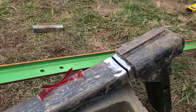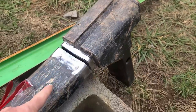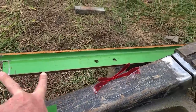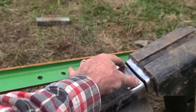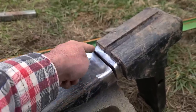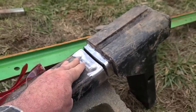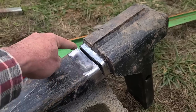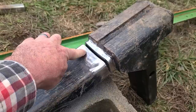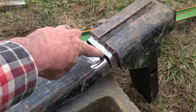I also thought, since this is hollow square tubing and I have access right back here, you can stick your hand in there all the way through. I think I'm gonna cut out one more small section, like a 3-inch section, and then put it across here on the inside, prop it up in there, and just fill in this void. And then there's not a gap, you know? A little bit extra, since this is a weak spot, it would give it a little more stability. Basically I'll put the face of it up like that, probably prop it up there with a piece of wood or something, then tack it in place and run some really strong beads to fill in this section.